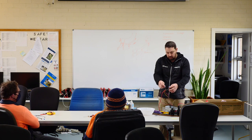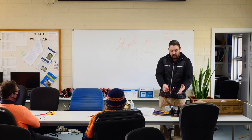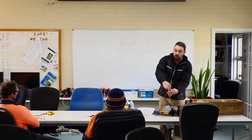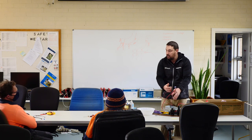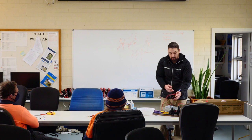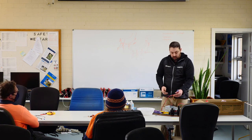That can tend to look like a bit of an improvised homemade explosive device sitting in a valve box with wires and colors going everywhere. So I tend to try and keep things neater - when I do installs I'll put a cable tie around it to keep it neat, then do the next valve and bunch them all together with another cable tie. You've got that all tucked neatly away in the valve box, and if you ever need to work on it you can pull it up and actually see what's going on. You can cut the cable tie to service it but you don't have a field of wires everywhere.